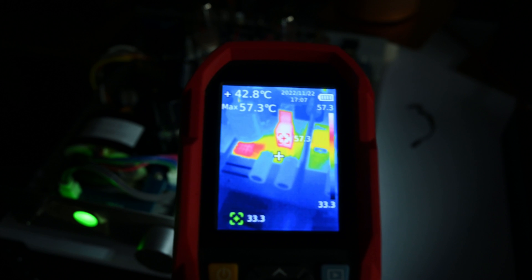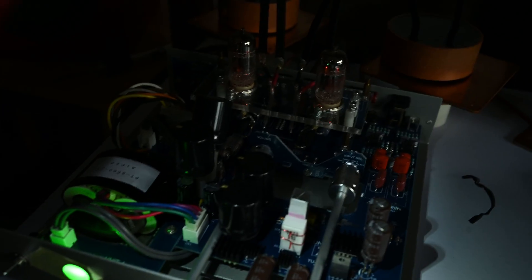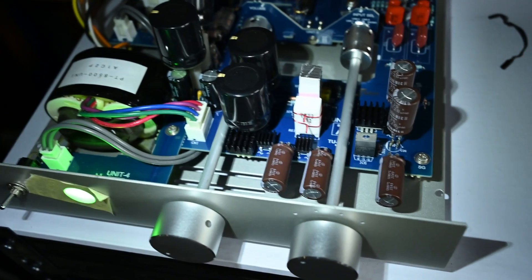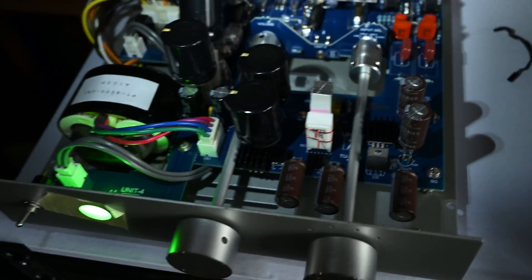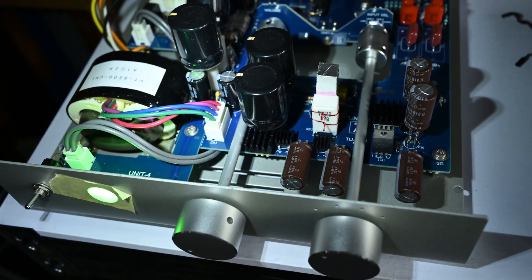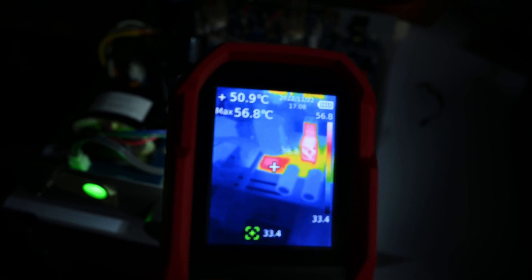The other diodes are simply red and yellow — not so hot. Let me boost the ISO a bit. The center diodes — the small heat sink ones — are not so hot. The biggest heat sink is on the center one, which is kind of under the capacitors — that is one of the hottest diodes. We can see the temperature now, and it's not so bad. The temperature on that big one is about 50 degrees. 50 degrees is not bad.